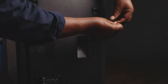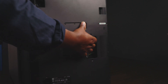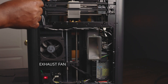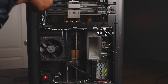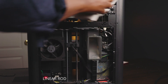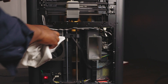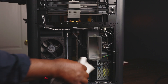Let's move on to the back section — I notice a number of videos don't emphasize removing the back section, which gives you access to the rod and the lead screw which are hidden. I believe that to give this a thorough and proper cleaning you need to remove the back section. While at the back section you just want to give everything a really good clean — you have the exhaust fan, the poop chute, all the electrical components. After homing your device, you're able to move the bed up and down giving you access to the rod and lead screw for thorough cleaning.